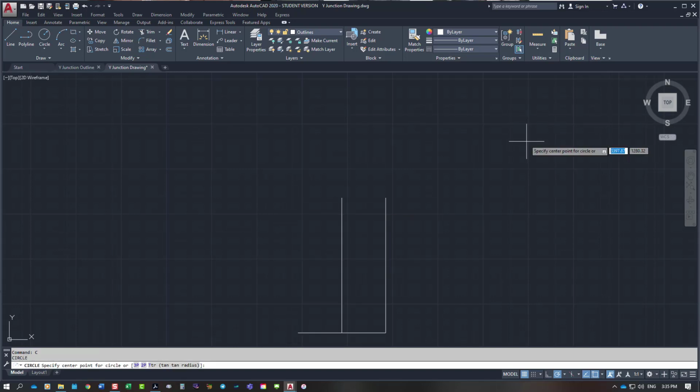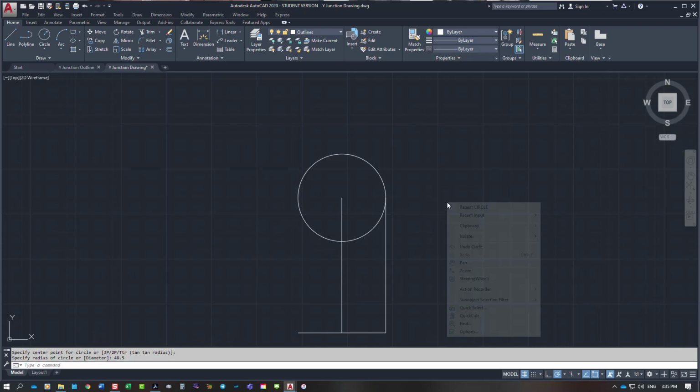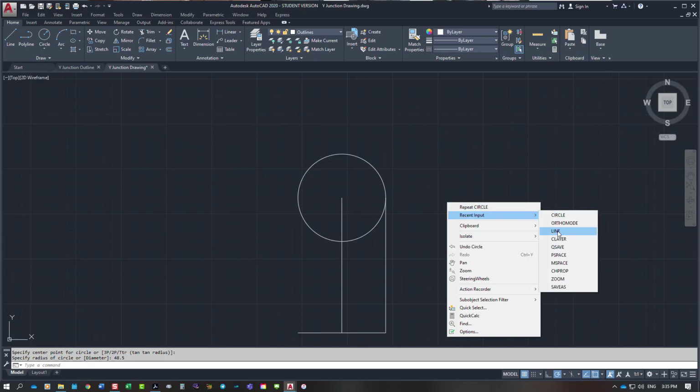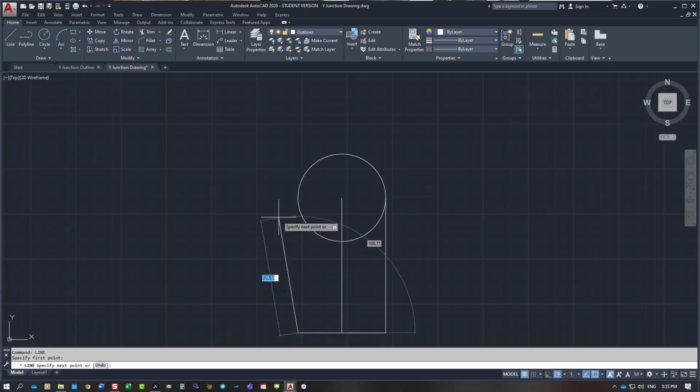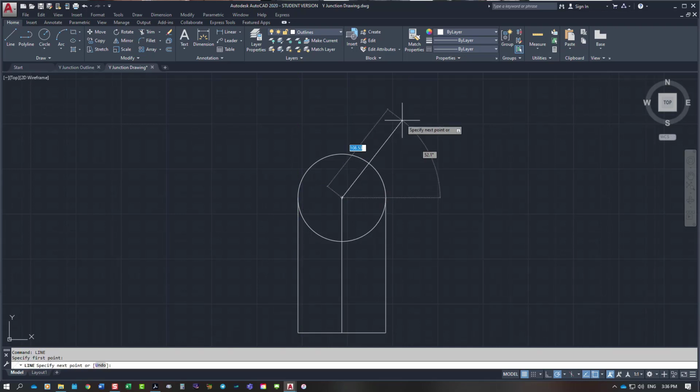So this is going to be the common central sphere, being 97mm diameter, has a radius of 48.5, and I'm going to bring my baseline up on the other side. Just come up to the edge of the cylinder, that'll do. I have to go away at 30 degrees on each side, so I'm just going to type in a dimension of 400. Same out the other side.